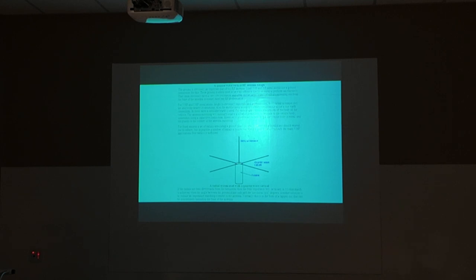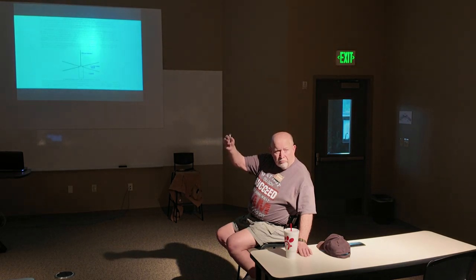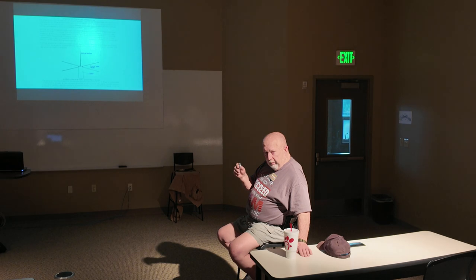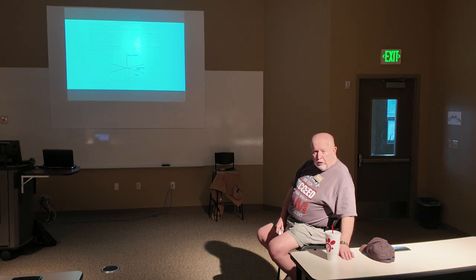And if we had the opportunity, this was field day, and I'd run a class this past field day on verticals and so forth. But if I had the time, we could set up a vertical and we could run wire out, just any length wire, and it would work really well. You'd get the SWR down pretty good by tuning the length of the emitting part of the antenna. Then if I went around and cut each one of those wires to a quarter wavelength, the tuning would be totally different. You'd have to go back and retune the vertical part of them. So it just proves the point that it's necessary to be careful how you measure things and what you put out.